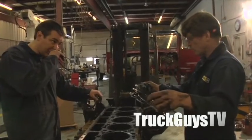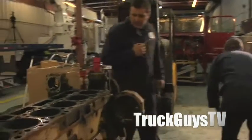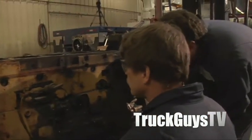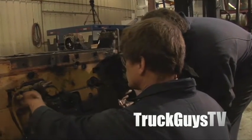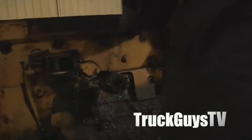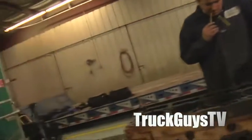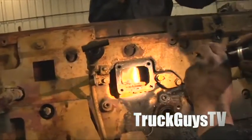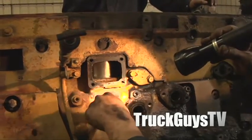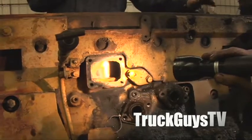So that could be coming from a liner seal - a seal on the outside of the liner. Actually, you can see them from in here. There's the liner, the outside of the liner, and there's a seal right there. There's three of them in a row. So those seal - there's coolant all in this passage. It's going past those seals and dripping right down into your oil pan. Here's the outside of the liner and there's coolant all around the outside. There's three O-rings on the bottom - one, two, and three - and they're going past all three O-rings and the coolant's dripping into the base. That's where this problem is probably going to be, I suspect.